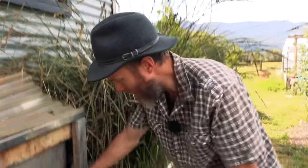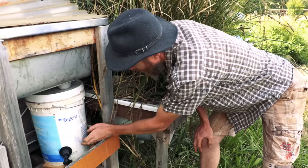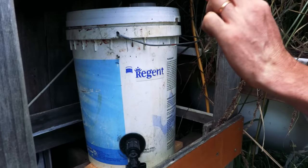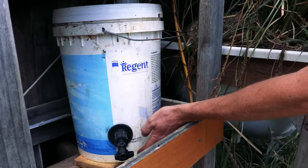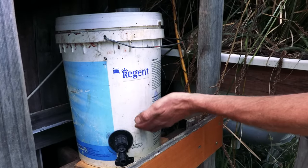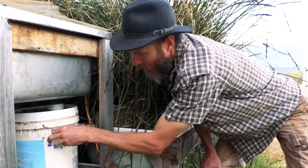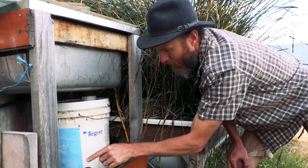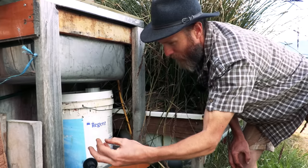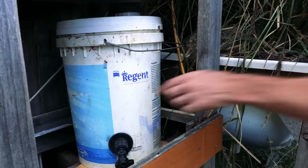Underneath that you've got the grease trap. The drain pipe runs down a tube that finishes at the bottom, sending the dirtiest water down there, and then the water has time to settle — the further up you go, the more clarified it is. At the top you'll have oil, since that's lighter than water, so you don't want overflow from the top. The outlet is halfway down with an elbow joint, so the water flows out at the clear level of the bucket.